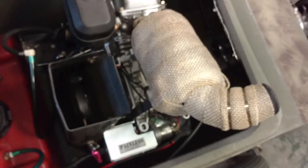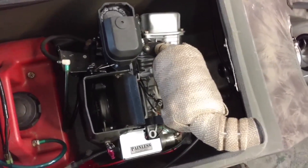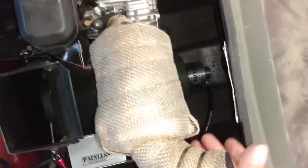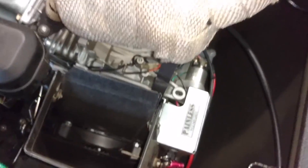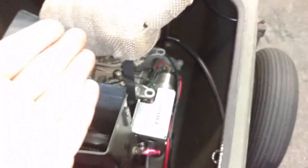One-handed. As you can see now, the motor is out of its cradle and it's just sitting in there. For simplicity of this video, I won't take the motor out. But it's ready — you just pick it up and it comes right out. There are motor mount feet; you'll see the little slots down there. Once it drops in place, you push the motor locking lever forward again and that will move the motor back, locking it in place. Now it's time — you can come back to the pump.